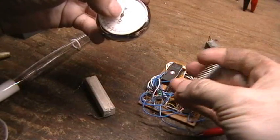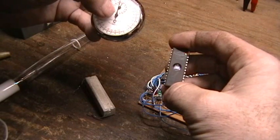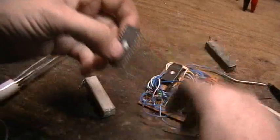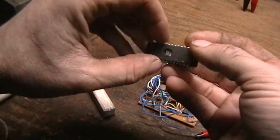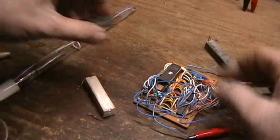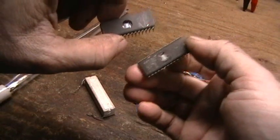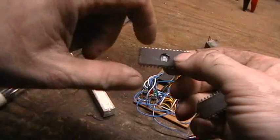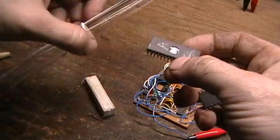And by 30 seconds, if I pulled the power to the light at just under 30 seconds, the cells pretty much all read straight FF, or blank. I've already been through this several times. I was kind of surprised at the result, so I pulled out several different EEPROMs, programmed them with all zeros, put them in the reader, and ran them until they came up blank, then shut off the power, waited a little bit, and re-read them again. Then programmed them again to make sure that the light did not damage the EEPROM — and they programmed back to zeros just fine, and then erased back to FF again in under 30 seconds.